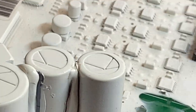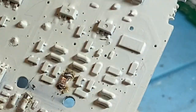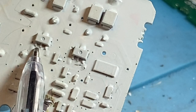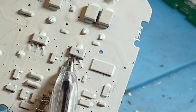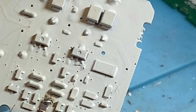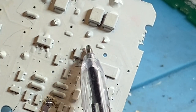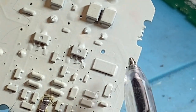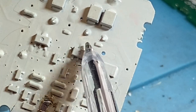The next main failure point, or actually can be blown up if that goes open circuit, I even lose my own bearings on these sometimes, is these two MOSFETs here. They're N-channel 200 volt rated MOSFETs. They are the first line of the switching for the receiver input. They block the transmit pulse. You need two in series the way they do it to block the transmit pulse. But also, these stand off the flyback pulse at the 200 volt. We'll call it, how about we just call it 200 volts instead of 185, 195, or 165, whatever I've seen. Okay, so these things turn off, and that flyback clamped voltage can't get through, right?